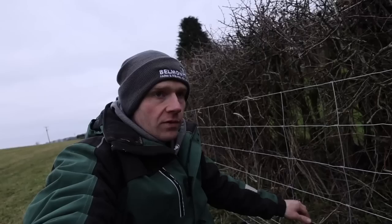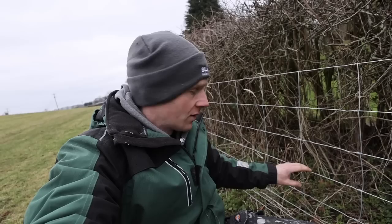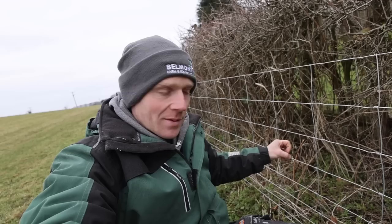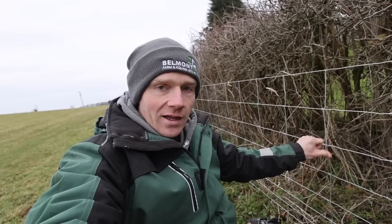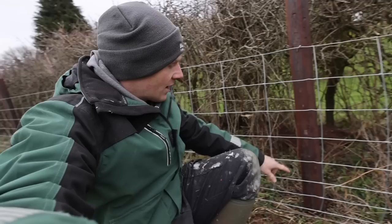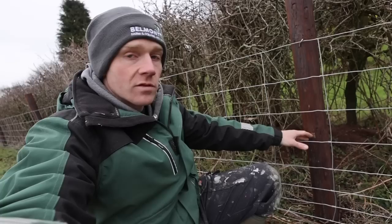The actual fence we're using — this is all Tornado high tensile netting and this is called lamb safe. For those of you who haven't come across it, it basically is a wider version of a standard sheep netting. By having it wider it means if a lamb does get its head through, you can get it back out again, because when they're square they're almost the perfect size to get caught. Undoubtedly we're going to have goats getting stuck with their horns on here anyway, and unless you use horse fencing — which is a lot more expensive and a finer mesh — that's always a risk. So what we'll probably do is about 400–500 mm off the floor, put some offsets and run a bit of polywire along there to keep them just off the fence altogether. But there will be occasions where we want the goats to trim back the hedges — we can de-electrify it for those moments, they can trim it back, and then we can keep them off it when we don't want them to.